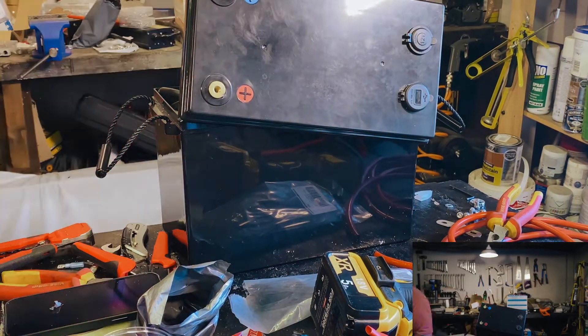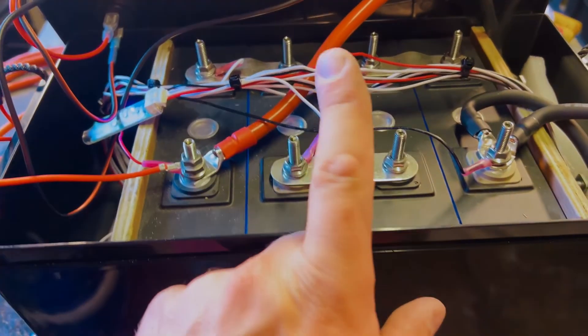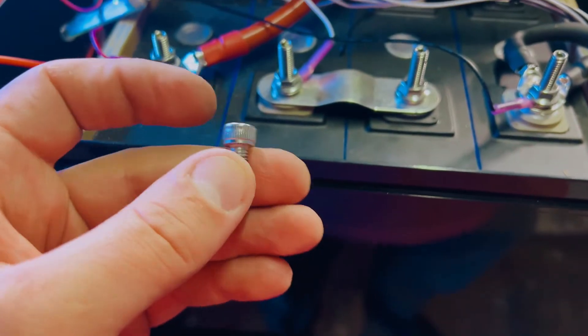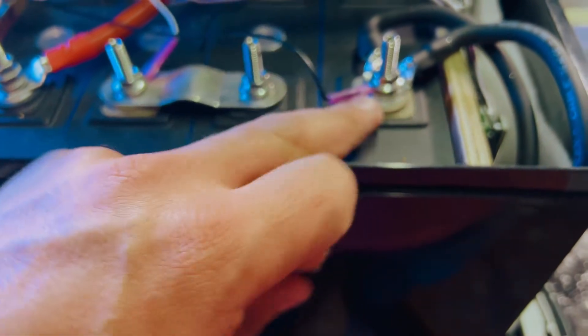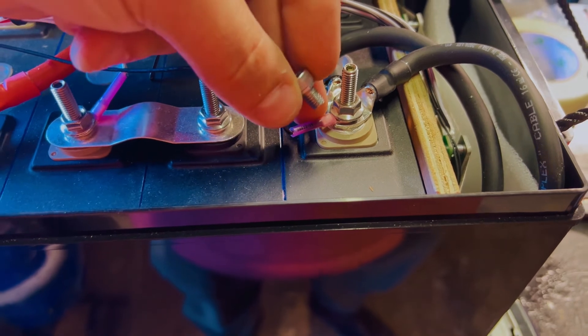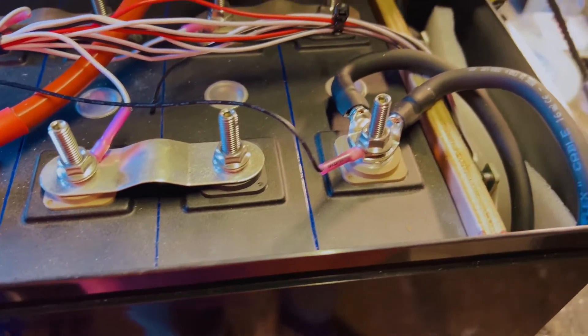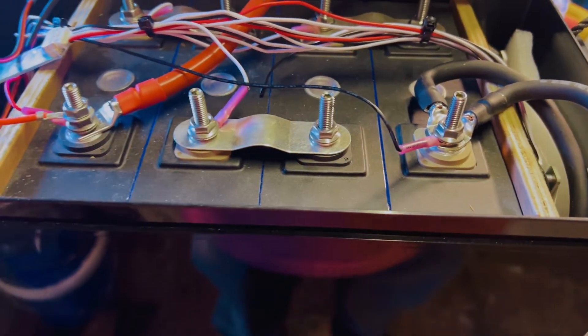You do have to buy the app for the Overkill BMS. I ended up going for grub screws instead of the tiny little 6mm bolts that came with the battery cells, mainly because putting a third lug on for the balance lead just didn't work. I didn't have any shorter grub screws - I think these are 40mm, it could have done easily with 30, probably 25 would have been fine, but this is all I had.